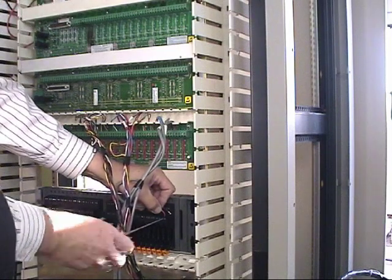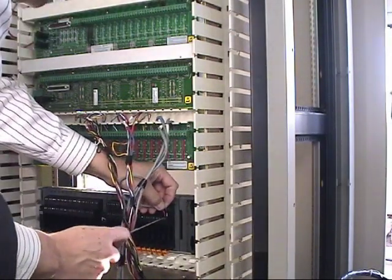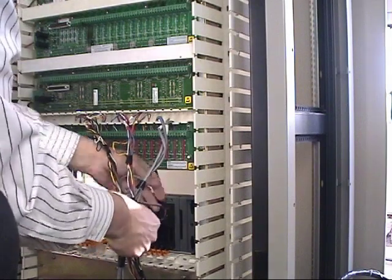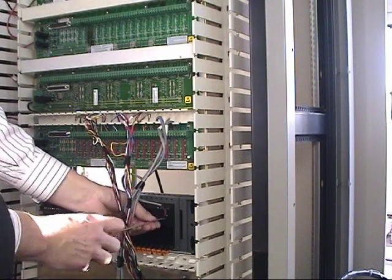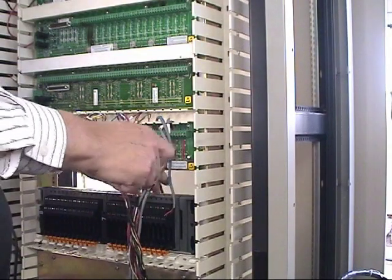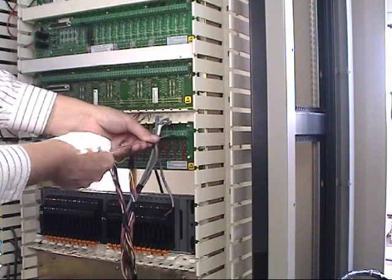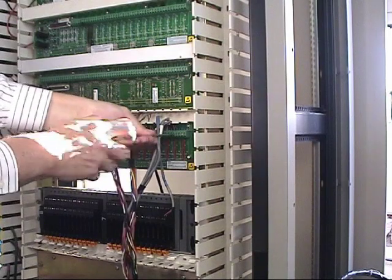As part of the process, we want to note that all wires are dually tied, and possibly have an apprentice work with us to keep a paper list of all the wiring moved from one position to the other, so we have a record for validation of each terminal screw that's been moved. Because this wire has not been disturbed at the field end, we may find that we can reduce our testing effort, since no field termination was modified.